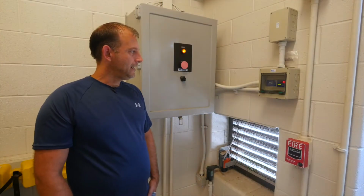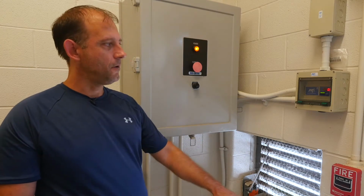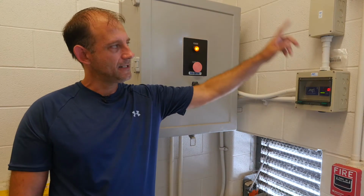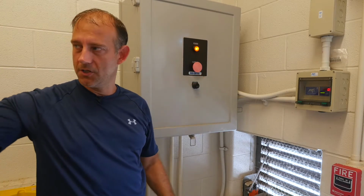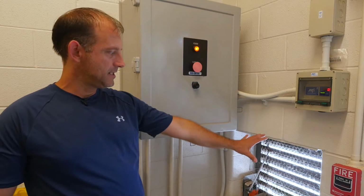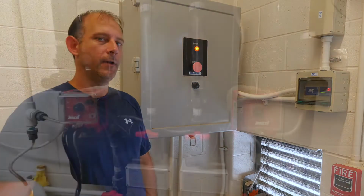So here's our chlorine leak detection for chlorine safety. We have a detector down there. Once it detects any parts per million of chlorine, chlorine's 2.5 times heavier than air, so chlorine gas falls. Once that detects chlorine, it sends this up. Once this hits a 0.2, it sets an alarm outside. We get the alarm. When it hits 0.5, it automatically closes. It sends the signal to here, it energizes a battery, it closes all of our robo controls, so then the chlorine leak either goes away, it opens this exhaust fan, we vent it out, we get the alarms. Of course, we wait till it says 0, we put our mask on and we come in here and find out where the leak is.